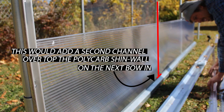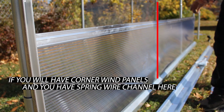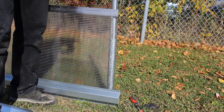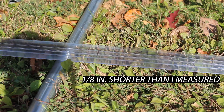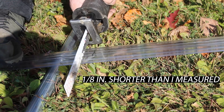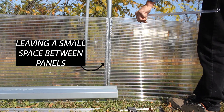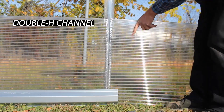After we install our channel, we're going to rough in our single H channel at the panel's top. If you're doing corner wind panels and have a second piece of channel on your second bow, you'll have to cut this single H channel to go between your first and second bow, and then from the second bow on. When we rough the single H channel in place, we can go to its very end where it will ultimately meet another piece of polycarbonate. This allows us to measure the space between the top of the metal baseboard and the bottom of the single H channel. I'm going to cut a piece of plastic double H channel to that size — cutting it one-eighth inch shorter than measured for a little flexibility. I'm then going to position my next polycarbonate panel, leaving a small space between it and the previous panel, making sure the top lines up with the first panel so it follows a straight line, and then begin pushing the plastic double H channel on from the tops. This is the easiest way to get the plastic double H channel seated all the way down to the metal baseboard.